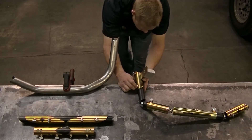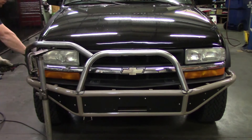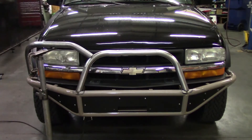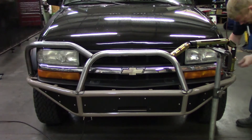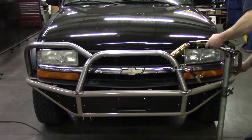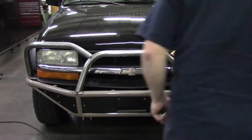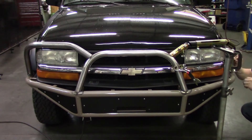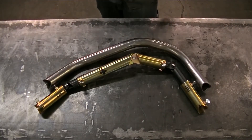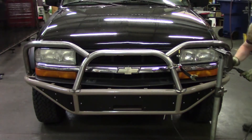Last I adjust the cope length and rotation to match the other tube. Now that I have a mirror image of the first tube I can go back to the vehicle. I'm done with the first tube so I can set it in place, do the final adjustments, tack it, and then move on to the next tube. I move my stand over, grab the tube jig, set it in place, then measure the end of the first tube to a reference point so I know where the second tube has to go. I'll grab my tube holder for the final positioning of the jig. Once I get it close I can use a spacer block to check fitment against the body — it turns out this side needs to be about a quarter inch longer so I'm gonna extend it in the middle. I like to take my time and check fitment from a lot of different places so I know the tube jig is fitting perfectly. Second tube — hey, look, there it is — and it fits pretty good too. I can tack it in place.